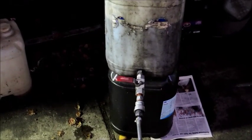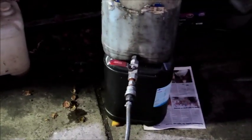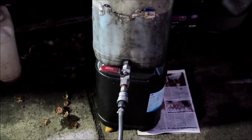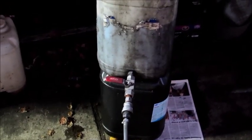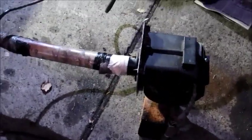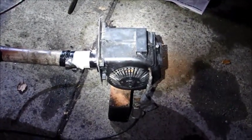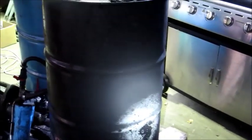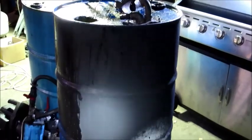I have an electronic controller which runs an electric pulse pump — that's good for long-term running as it keeps it very stable. But for short runs like this when I'm standing around, a ball valve is perfectly adequate. To supply air I've just got one of these blowers — I bought it from a surplus place for about 10 bucks — and that's just a bit of PVC tube that blows air into the burner.